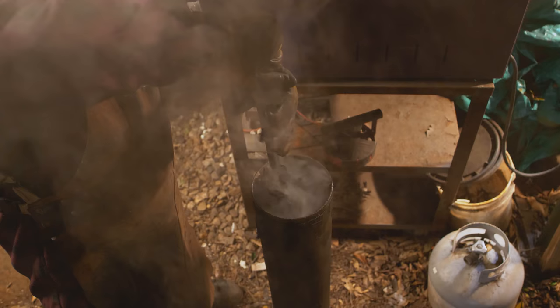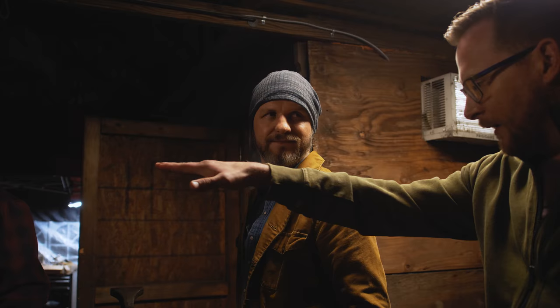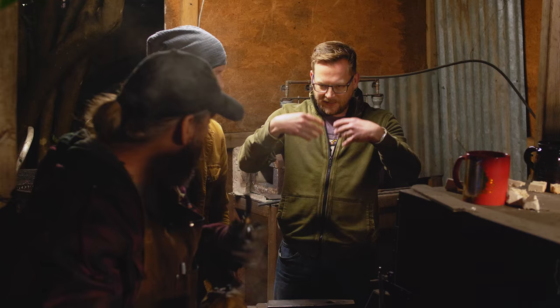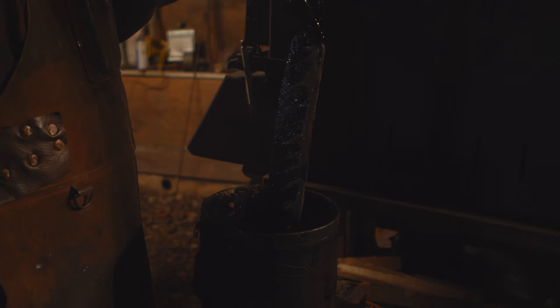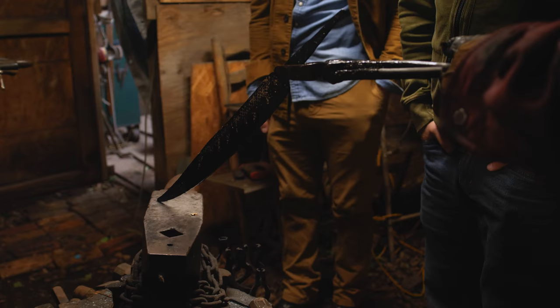So in that moment, we saw a little bit of flame up top, which I assume, as it went in, you reached the flash point for just the upper layer. Yeah. But meanwhile, you have a cold reservoir of all the rest of the oil, so it didn't last very long before it went out. But in that time, it started wicking away all of the heat very quickly from the edges, but keeping the heat along the part that we covered in clay, right? Exactly. Nailed it. Science adjacent. Science adjacent. We have a slight bow.